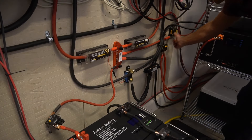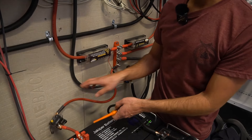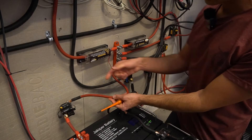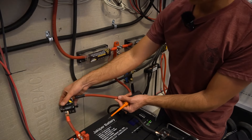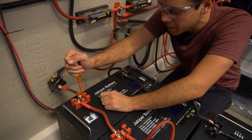First we're going to disconnect these batteries. Next we're going to remove this circuit breaker because it's too small for this test and then add some larger conductors. I'm going to turn on one of these batteries momentarily so that we can still run these inverters and then I'll disconnect this. Now we have glasses and we can work with battery terminals.